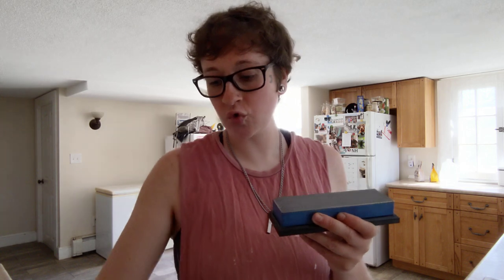Let me pull out my 325-grit here. This blue stone is my 325-grit coarse diamond stone. This will move material within just a few passes. You take an S30V Bug Out that needs a fresh edge — maybe five passes on this — and you're already going to have a burr. They move material very quickly, they're really efficient, and they're so hard that if you have a super steel like Maxamet, 10V, or 4V, this is going to move that material no matter what, very, very quickly.